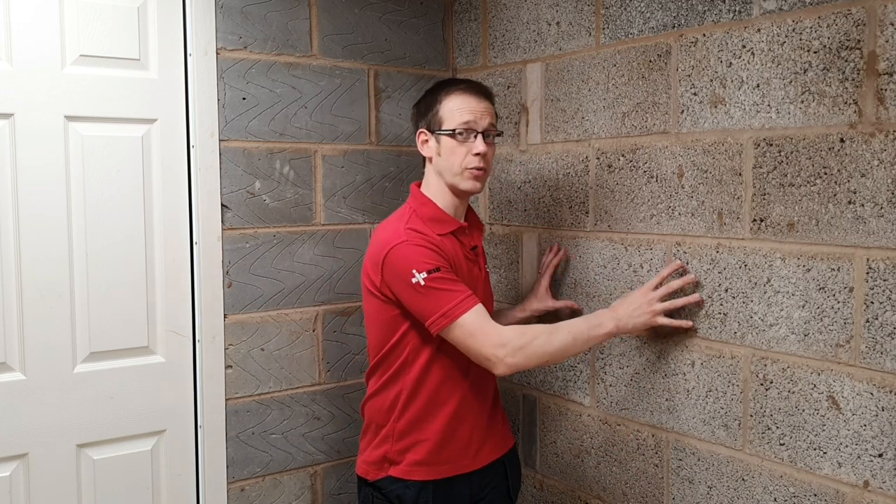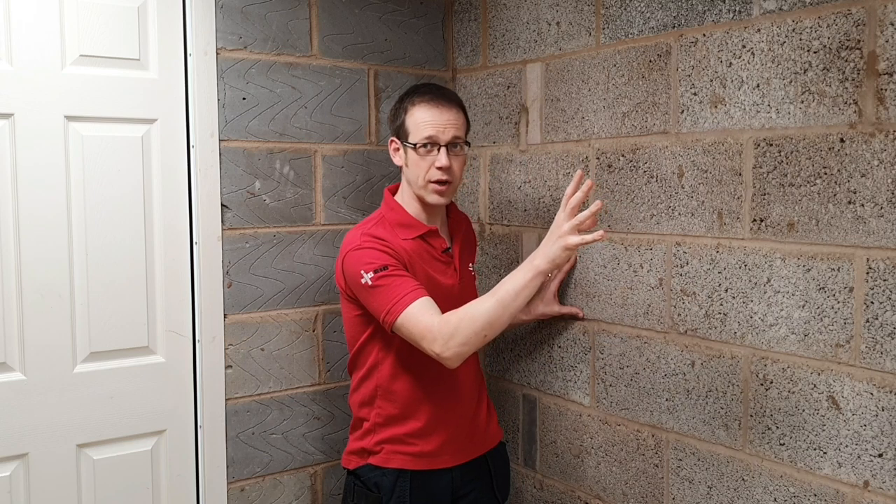The only other small downside is it does get quite chilly in here, so I've decided to install a heating point down at this end of the garage — in fact, on this wall right here. It just so happens that the other side of this wall is the existing boiler, so I could just extend the wet system, bring a couple of pipes in — flow and return — and put a normal wet radiator down this end of the garage. But I'm not too keen on that, one reason being that the existing boiler is running at or very close to its maximum output rating already.